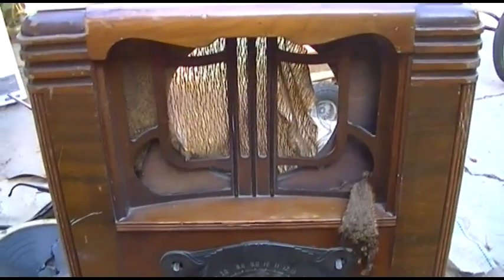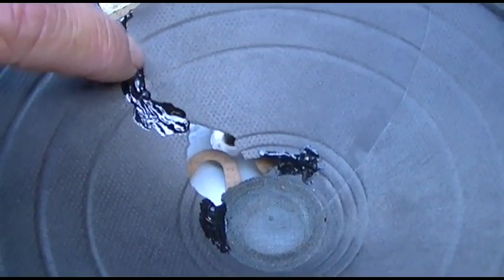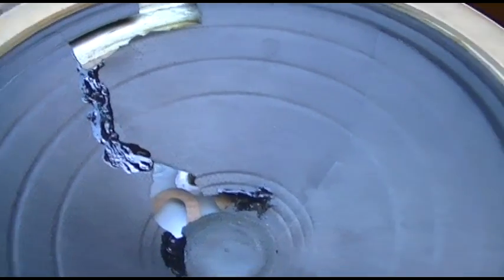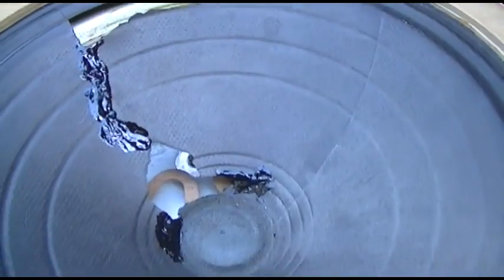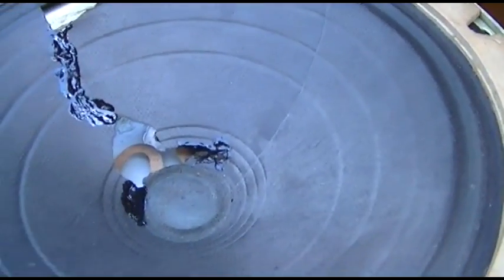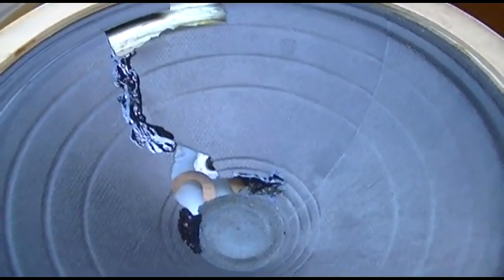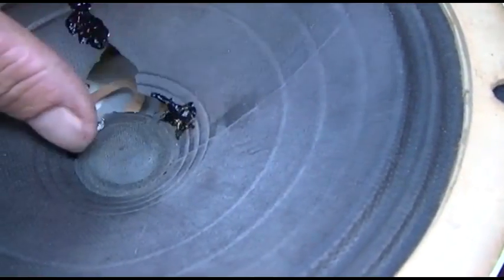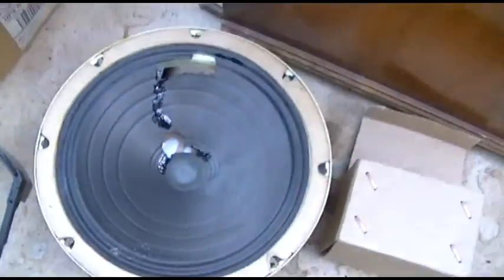Back on the Zenith farm radio — I repaired the speaker as best I could. This is the actual appropriate speaker glue left over from my pro audio nightclub re-coning days. I'm not too worried about these holes here because we're not producing really any bass with this, and there's no compression behind the thing. It's just in an open box and it's just going to be used to reproduce some low-level voice, so this glue is extremely hardcore.